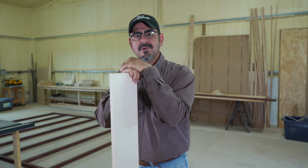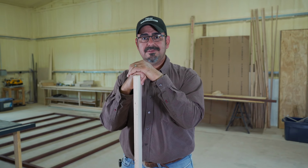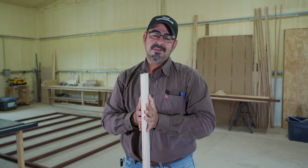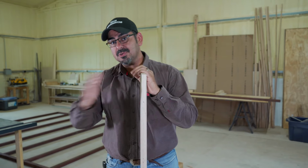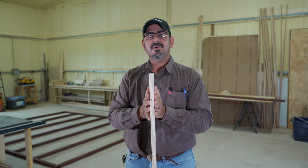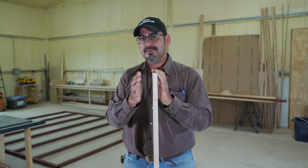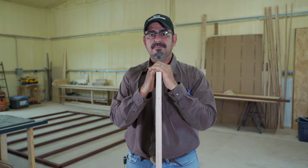Okay, well, I have 3/8 rebar. Okay, well, what spacing, right? Because you can have 3/8 rebar, but if you don't specify the spacing, that's another variable, right? So well, I have mine at 12 inches on center each way, that's how you create your grid, or I have mine at 16 inches on center, so on and so forth, right? So now that's your 4-inch slab. Now, is a 6-inch slab better? Well, it can be if they are built exactly the same.